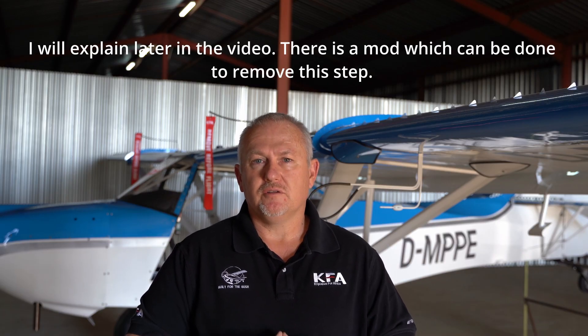We will be making a wing folding manual available on our website where there will be a checklist — it will be a requirement to complete that checklist every time you fold the wings. If you know you're going to be folding the wings often, it would be recommended that you do not install those fences, as you will have to drill out the 3.2 millimeter rivets every time. In total if you are two people you can do this in less than 15 minutes, and if you have very little fuel in the tanks it can probably take less than 10 minutes to fold the wings.